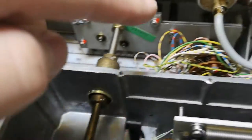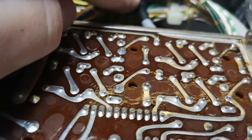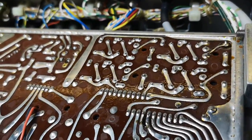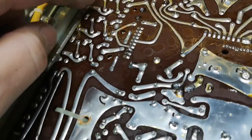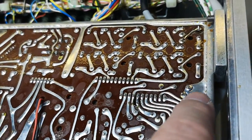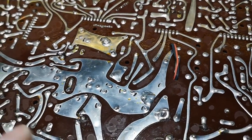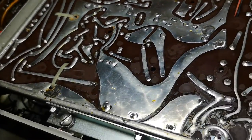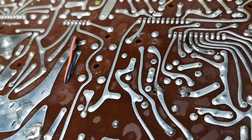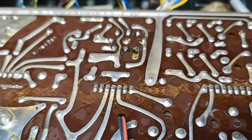The RF output is what connects the front plate to chassis — that is the one and only point to chassis. So there are no ground loops except via this PCB — really clever. Look at this sexy design, look at the traces — this is just so 70s. You would never do this today, but it looks just so nice. I really miss this kind of layout style. That track is just wonderful.